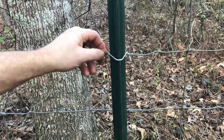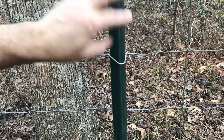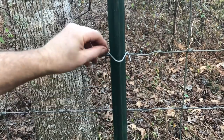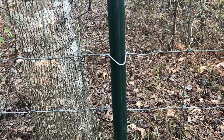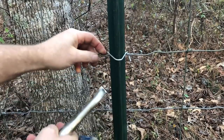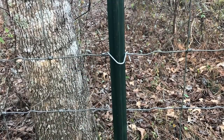Here's the example - a wire tie. These usually come with packs when you get fence, and they're for a T-bar post. You put them in, you wrap it around the fence, and you connect it by twisting this around the wire. You see somebody using vice grips or pliers, trying to get around this thing and swing it around and twist it, and you go, man, what are you doing?